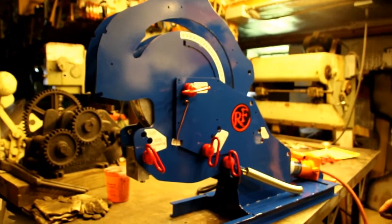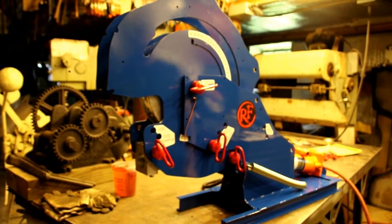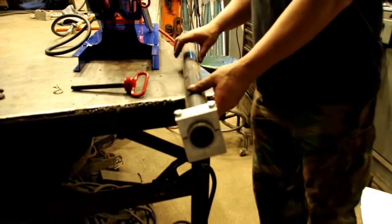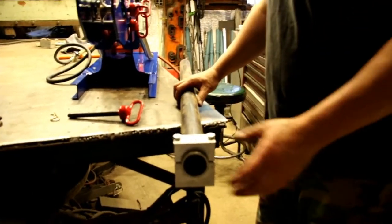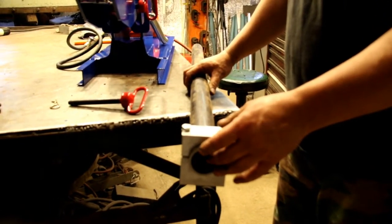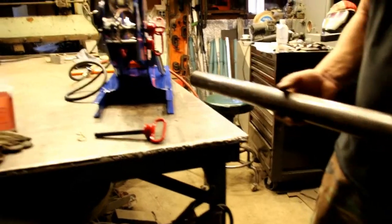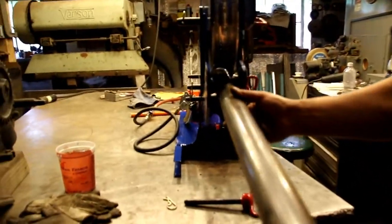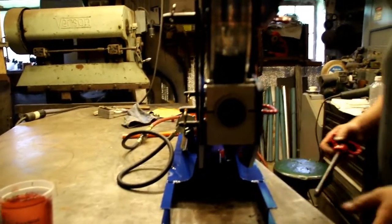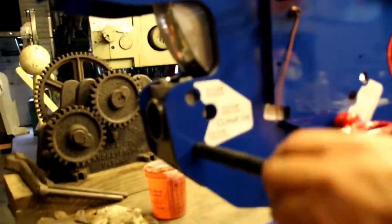We'll see what it does to the tube and if we get any deformation or not. What I've got here is a piece of two inch OD mechanical tubing with a 180 wall thickness — it's not your standard tube but that's what I have. I've got to do a bunch of bending and this is our two inch die with a six inch centerline radius. I've got both pressure dies in there. We're going to insert it on this side where it says six inch centerline radius, and just put that in there.